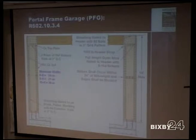8 foot is 24 inches, 27 and 30 inches. 7/16 minimum, where the others have been 3/8, so you're already using 7/16 typically. So 2 anchor bolts, and this here is where it's going to require, if you're going to cast in place L bolts, you can't use just the cut washer that comes with that.